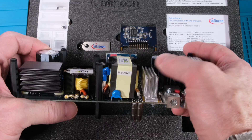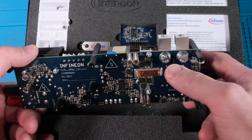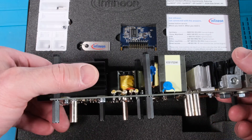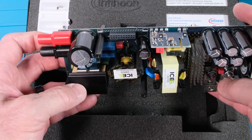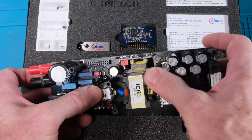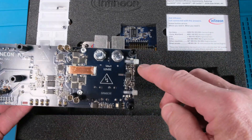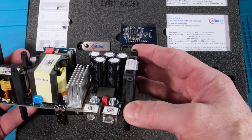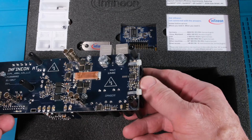I just want to point out how small these heat sinks are for a 600 watt power supply — pretty small. This one for all the output transistors, and this one — look how small it is compared to my thumb — it's just got two TO-220 devices on it. That's how efficient this is, how smart the design is. The magnetics are also very small. There's also circuitry underneath the fan for fan control — it's not just simple power-on, there's some smarts to when the fan turns on and off.